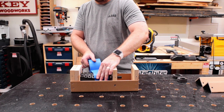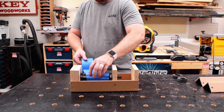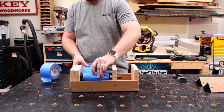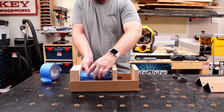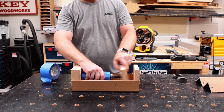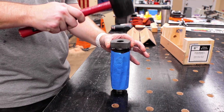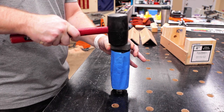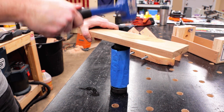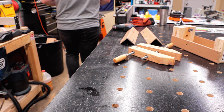I'm keeping the new head in the packaging it came with and wrapping it up with some painter's tape so I don't cut myself, because these helical heads have really really sharp blades and the last thing I want to do is cut myself when upgrading my machine. After I've got it all wrapped up nice and tight, I take it out of the box and use my dog holes in my assembly table to reattach the bearing block assemblies on both sides. I've got the pulley shaft inside that dog hole and I'm going to town with a rubber mallet, but for the other side I had to get a three-pound sledge — but I got them on.